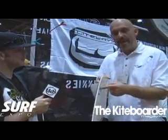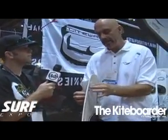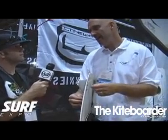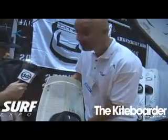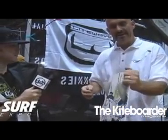And we went back to a 1/4-20 bolt. In previous years, I had a thinner fin with a small bolt, fine threads, but we had some problems with threads stripping and things like that. So we went back to a 1/4-20, same size as you have on your top inserts. Awesome. So that is the Vision 09.